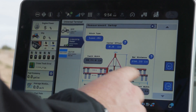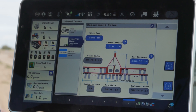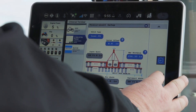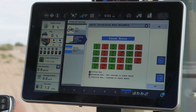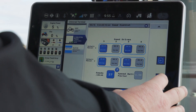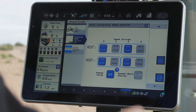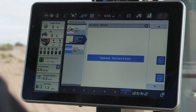I keep checking out my measurements, walking through. Anytime you see a bar distance that is a number that's not normal — not a normal measurement from our drop-in to our seed application point — we want to make sure that we address that. They are published in the operator's manual, but that information should be pre-populated by planner configuration. I come into seed rows; I've got those disengaged like we talked about. I've got my seed drive split as well with my different default rates set in there — my default rates for vacuum, bulk fill, and my seed product delay.